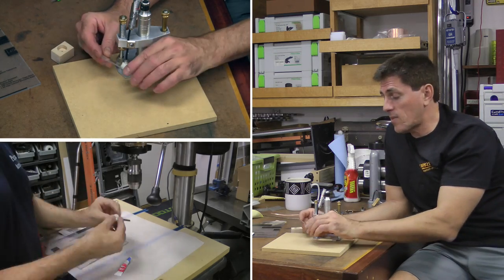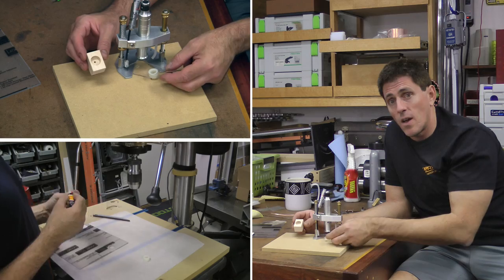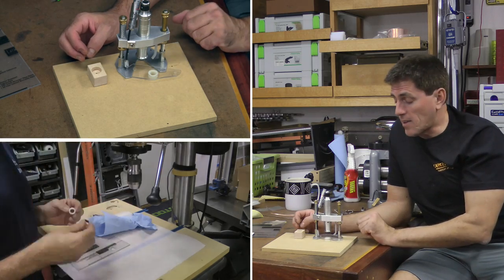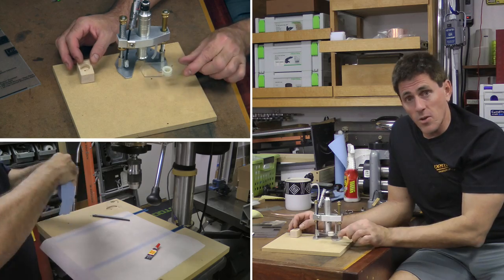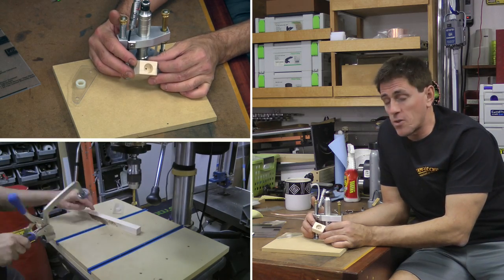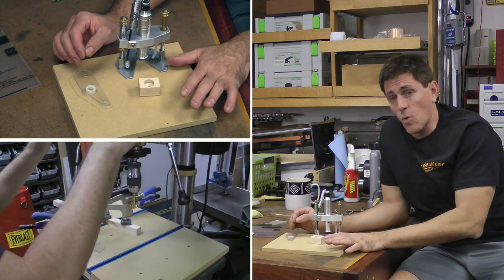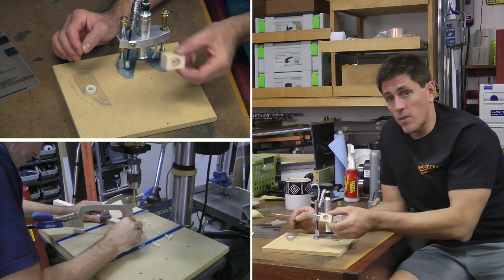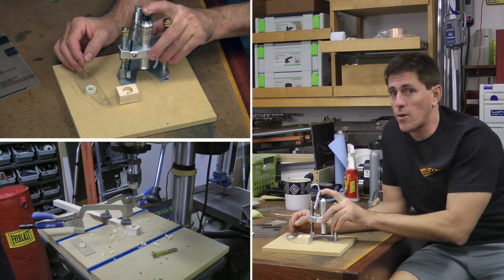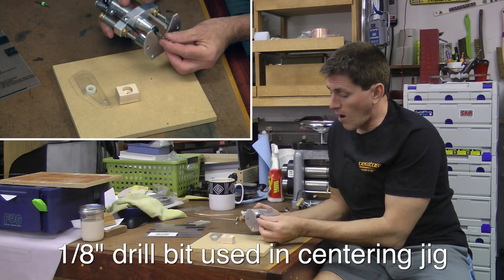Then we had to figure out where to fit it on the base, and that's where I needed to make a centering jig. I need the centering jig to ensure that when I place the Lexan piece on here — even without screws — it is perfectly centered onto the bit in the collet, so I could drill and tap all the holes correctly. What the centering jig is: I took a block of maple, used a three-quarter-inch Forstner bit to drill a shallow hole — deeper than the nylon projection — and then without moving the workpiece, I swapped to an eighth-inch bit and drilled a perfectly centered hole all the way through. I chose an eighth-inch because the collet I use most often in this inlay router is for eighth-inch bits. So I put the eighth-inch bit in the collet and lock it in.